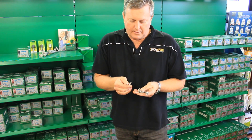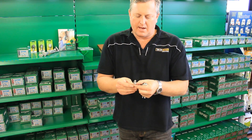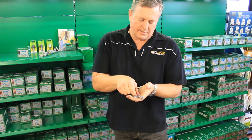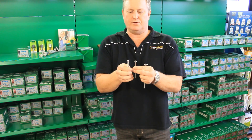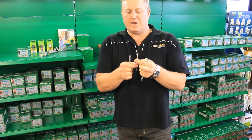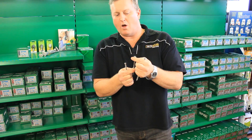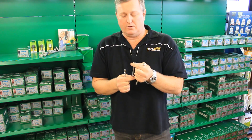The latest deck screw is called a SPAX-D — D for decking — and they use a completely new different technology. In Australia we're used to using bugle head, trumpet head, or countersunk style screws. These are not true deck screws. You can use them for decking, but with expansion and contraction you will find the screw, just like a nail, will eventually sit high of the board. And then when you go to re-tighten them, it's very hard and you often break them.